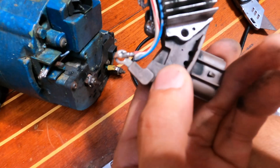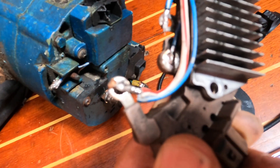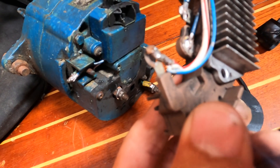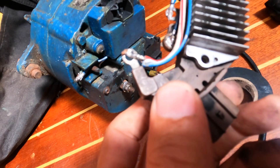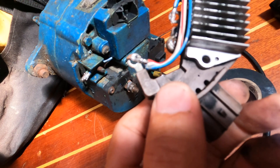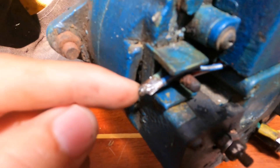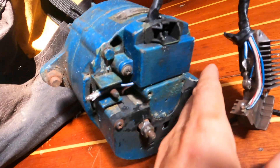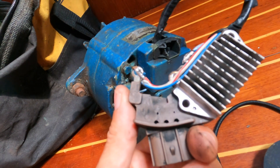It's going to be a short segment because you're probably all tired of seeing people fixing their boats all the time. Just an update on what is going on here. I peeled back the electrical tape and saw why they put the tape on — the connectors have holes on them and instead of putting an electrical connector with a little nut and washer to hold it together, they just soldered them on, which I think is going to be prone to corrosion. I'm going to have to keep my eye on that, or sweat them off and crimp on some connectors and find some bolts.